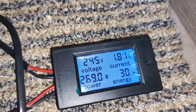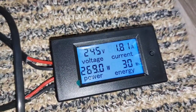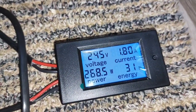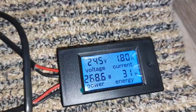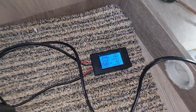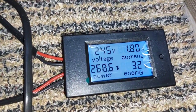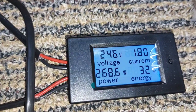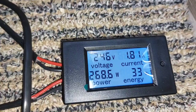So it's showing 1.8 amps currently — I've got the heater ticking over very slowly and the battery charger has probably kicked in as well. I'll just go and stick the oil-filled radiator on, which is 800 watts. Rough calculation: it's about 1 amp per 240 watts, so 240 into 800 is about 3.3 amps, meaning I should see around 4.9 amps. Bear with me — I'll just go and switch it on.